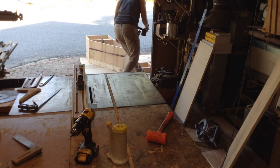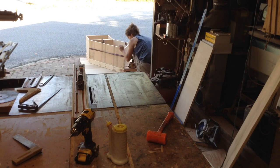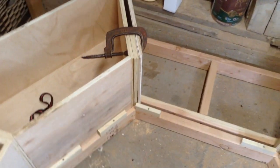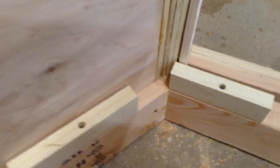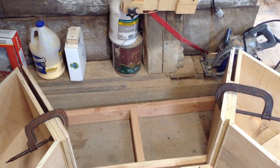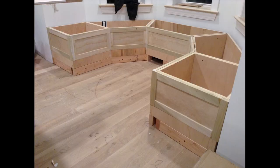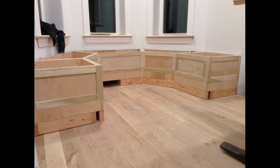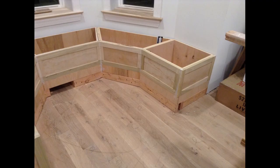What I'm looking for is that the box doesn't overlap my 2x4 frame. I made everything about a half inch smaller than it should be because I've definitely gotten some tight clearances on built-ins and it's a little scary putting it in the space. For the last piece, I discovered I needed a three-quarter inch spacer — there's a throwaway piece of plywood in between these. Without that spacer it would pop out past my three-quarter inch block on the bottom, so with the spacer everything stays aligned. I made the sides the exact same way, then cut the backs. This is where that video ends — you can see how those boxes look as they start going into the space.